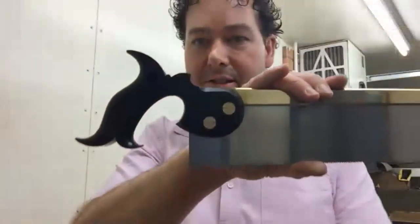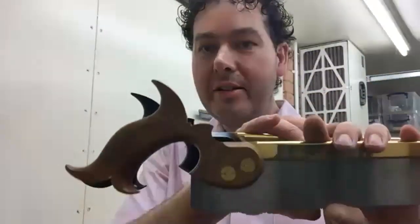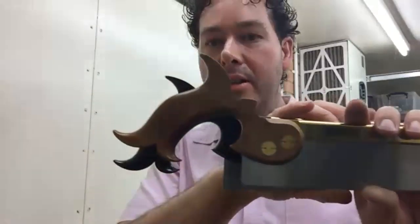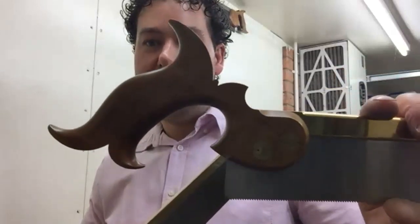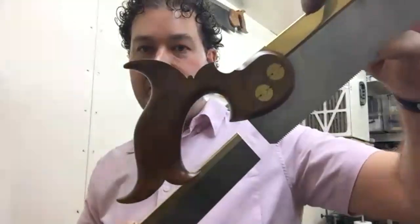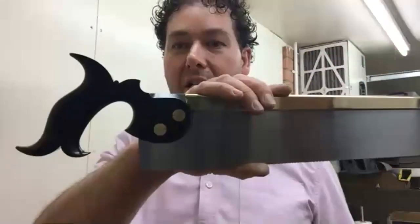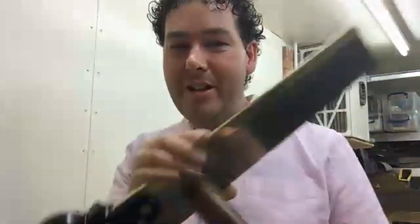this one. You can see how that one's kicked up higher by lining the backs up. And this is geared up for people that are cutting lap dovetails, mitre dovetails at the bench. So the saw naturally sits higher when you're sawing up, as opposed to having to kneel down with this saw to saw up. So we accommodate that as well, different hang angles. We try and have saw designs that accommodate all those different requirements.